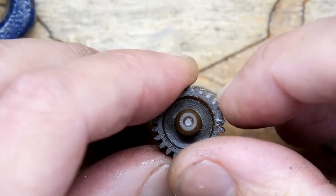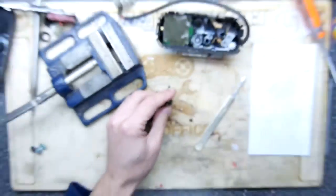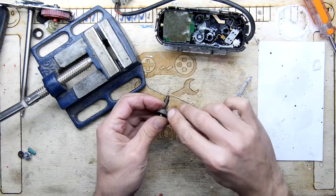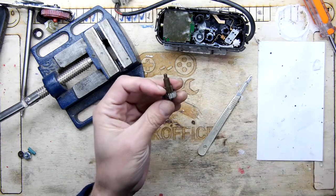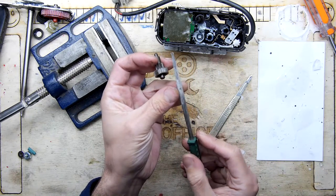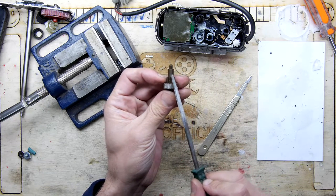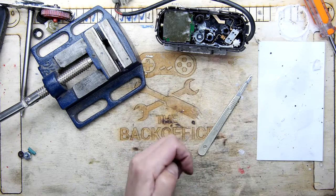It's not very deep at all, but it is there. When we make our cast gear we're going to have to go in and actually cut these, and it's easier to have a reference. You can see the real teeth are quite deep — a whole fingernail would go in there — but on this one it's very shallow. We'll get a very thin file in, and in fact I might even have to make a tool to do this because we need a very specific size, and we'll be able to run that in the groove we've made once it's cast.